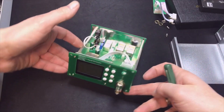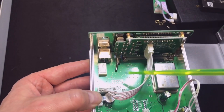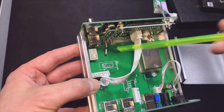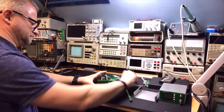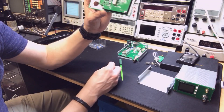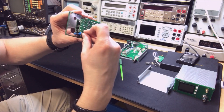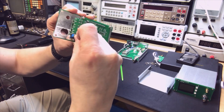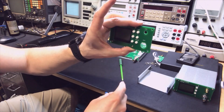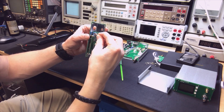We need to be very precise, but the holes are still there, so this is possible. The switch goes to the front and it's easy to just reroute the power to put it in between. Here is the space we have, and aligning it is not that complicated because it sits exactly stuck between the boards. I just need to have it as close to the display PCB as I can, and align it with the center of these switches — then we should be fine. It's just a matter of measuring correctly where to put the hole.